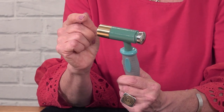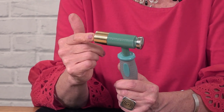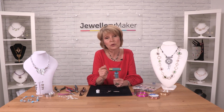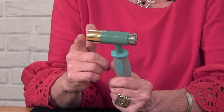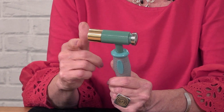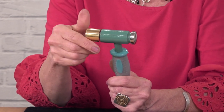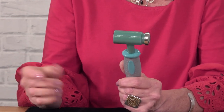The other head on the hammer is this brass one here. I know it looks very pretty, but it's actually meant for stamping — metal stamping. That's something I love to do to personalize my metalwork. You can also use it for just flattening your wire without too much marking, though you wouldn't want to hammer too hard. It's a soft head, so it hasn't got the weight of the steel. And this is interchangeable — this is where you put all the different heads on, and you can take that off very easily.